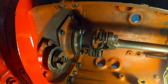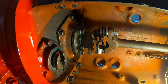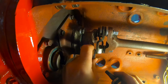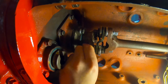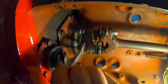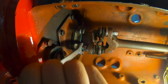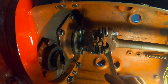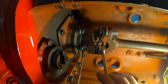And to rotate around to the final one, I'll release the clutch, rotate it so that we can access it, re-engage again. And we are 3/4 on the bolt head, 11/16 on the nut. So I will tighten these in an alternating manner. Work our way around a couple of times to make sure it all stays rather centered. This one's wanting to spin, so we'll get the backup on there. Once these are all tight, I'll bring you back.